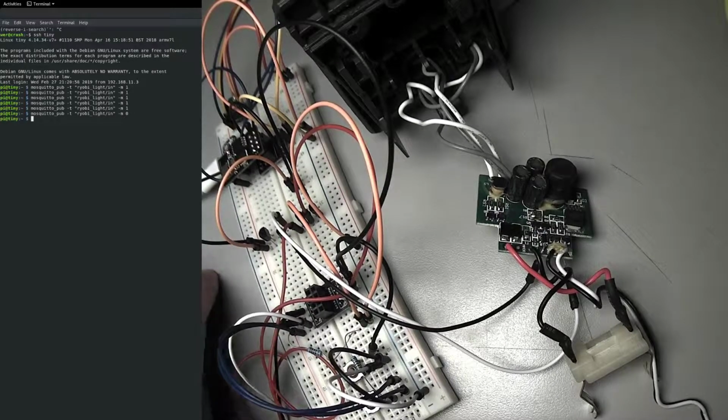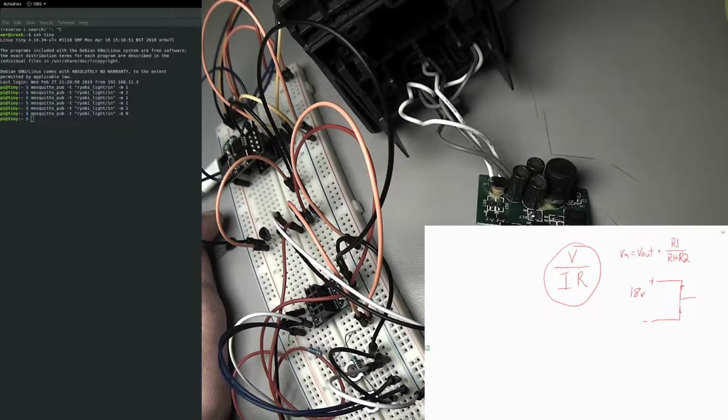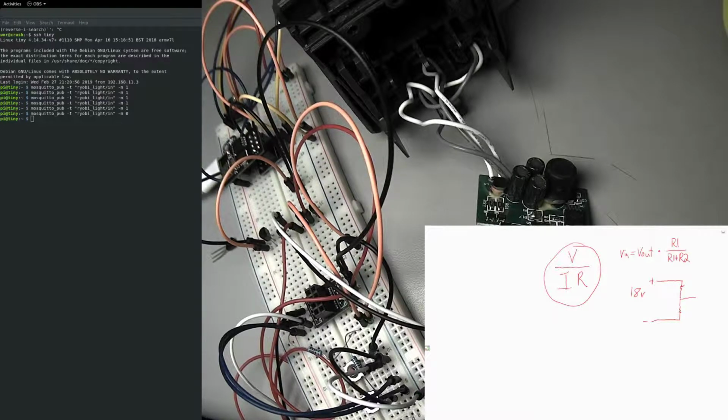Which I haven't done a ton of, but once I started to think about it, it actually seemed worse. And here's kind of my thought. I guess I never really thought of this before. So here's our basic resistor divider thing, and some of the discoveries I made along the way is, obviously if your values here are too small, then essentially you're just shorting, you're going to get current flowing here.